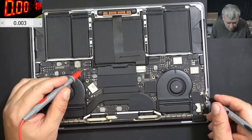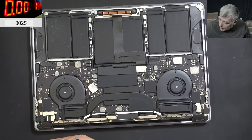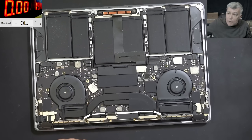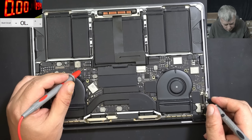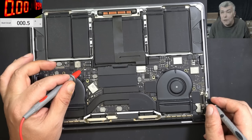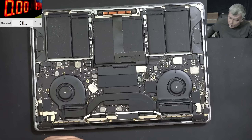Ground plus somewhere — zero. Why do we have zero? Because the battery is discharged, could be, but also could be shorted. So let's be sure. Ground plus: zero ohms. You can see on the screen — zero. So the main power really is shorted.